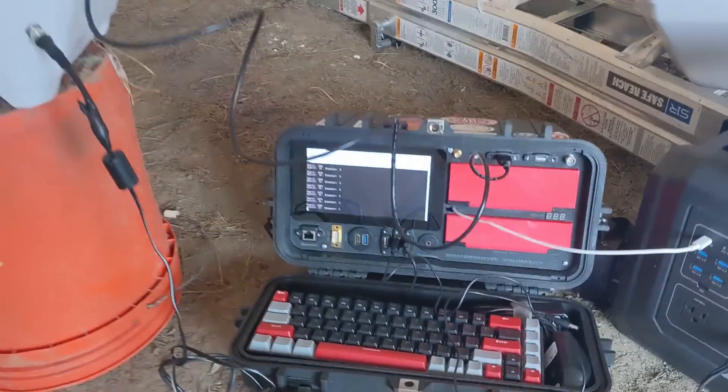We're going to be getting passive radiation coming through the dome from the sun. I'm not going to do the whole 180-degree azimuth, 60-degree elevation scan because that just takes too long — I'm going to do an abbreviated scan range that'll take more like an hour. Looking at the result, I'll throw an overlay up because this is not the easiest thing to look at. Specks in the sky — I'm starting to think those are Starlink satellites going past; those show up on all of my scans. Starlink uses KU band and people complain about it wrecking astronomy, and it's kind of wrecking my radio astronomy too. The blobby things down at the bottom are trees around the geodesic dome, and I'm kind of surprised I don't see as much of the dome structure in this scan — I can still see it, but it's not as obvious as it was in the last scan.